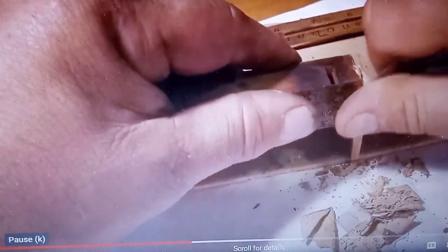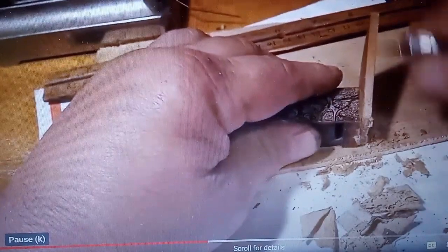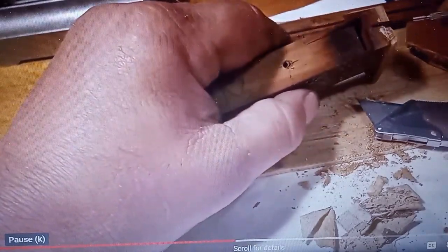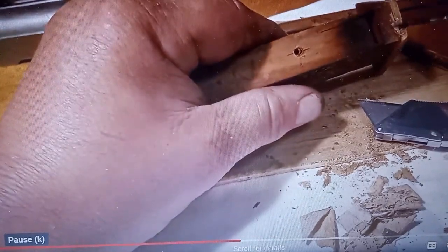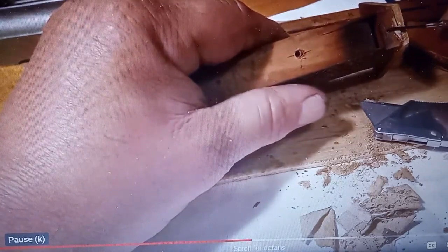And in this case, there is not enough bellow material on here to figure out how wide your new bellow is going to have to be. And you also want to blow into this hole to make sure it's working. Because this piece of wood here, with a combination of a few other things, has to be in the right spot in order for you to get the sound of the cuckoo. So I'm going to go ahead and blow into this hole, and it's working perfect.